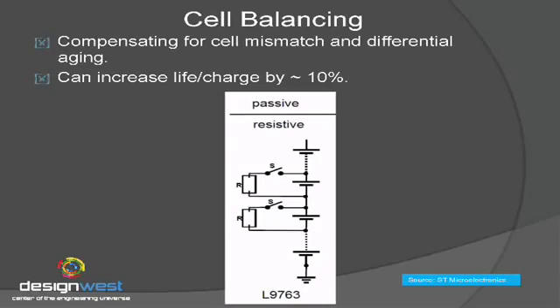If the battery goes below a minimum threshold, the gasoline engine turns on and starts providing electric charge so you don't fully deplete the battery pack. The other thing they do is passive cell balancing: because each individual cell is monitored, if it gets overcharged, they take a resistor in parallel with that individual cell and short it. So if the cell gets overcharged, current is diverted through the resistor instead of through the battery — you can't overcharge your batteries.